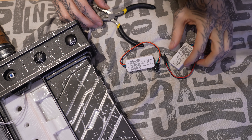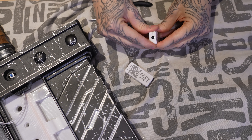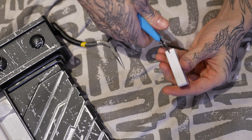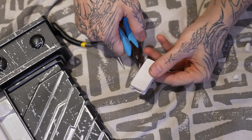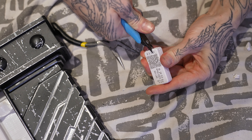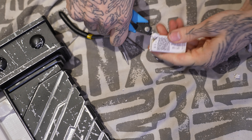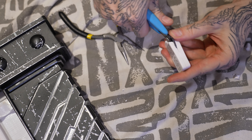Let's start with the SP110 Bluetooth controllers. I'm only going to demonstrate this for one of them. We just want to open it up — I've got clippers here and we're going to clip the thin side. The thin side is where you're safe to go; the fat side is where the actual Bluetooth controller lays, so don't do that side. Where you see the QR code, that's where you can clip or cut. The only reason we're doing this is to get access to the actual chip and solder points so it will fit inside the sword — otherwise it'd just be way too big.